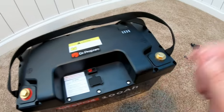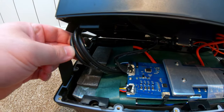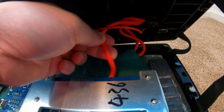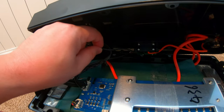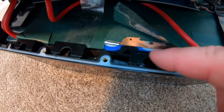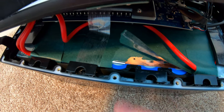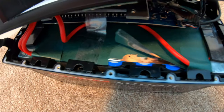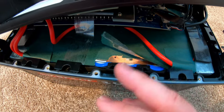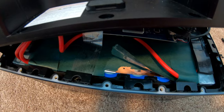There are some convenient screws along here — let's open it up and see what's inside. Here's the BMS. We've got three 10 gauge cables on the negative side and three on the positive side. The smaller cables go to the Anderson port where the hub connects in. I tore away a piece of paper and you can see cylindrical cells in there. There are only two other batteries I'm aware of with cylindrical cells like this — Battle Born and the GoldenMate Orion 1000. I love cylindrical cells; they can weigh a bit more than pouch cells but are quite a bit safer if one gets punctured.